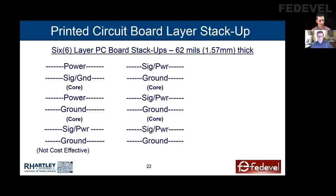This is a six-layer board that I absolutely love. I mentioned the people with the analog circuit that had the accelerometer problem where the amplifier was being interfered with. This is the six-layer board they went to to solve it. They only needed three signal layers, and they went to this to solve it.